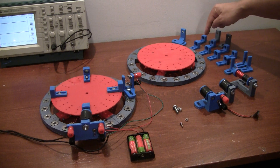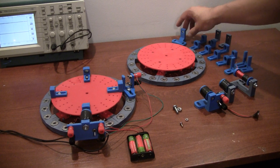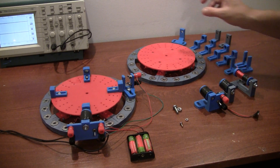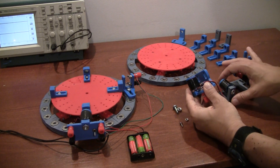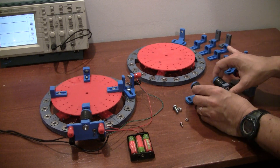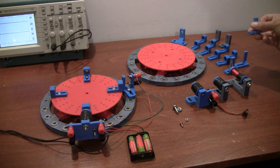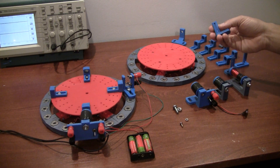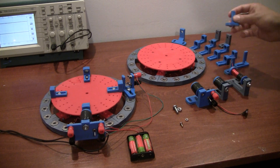These are different holders for different size neodymium magnets. I've got the stator pieces that I've tried out so I can mount different kinds of coils, and these are a few different coils that I designed to try out with this system. I've also been using reed switch actuation quite a bit — this is a reed switch actuator mount which I've just designed here.